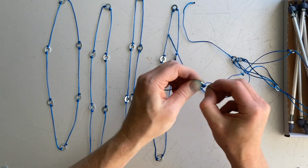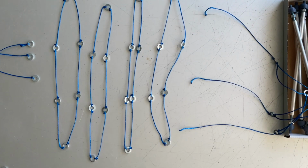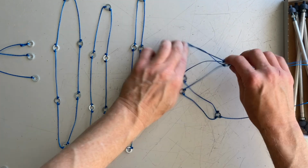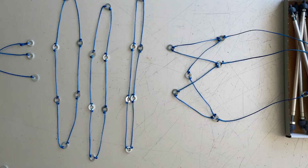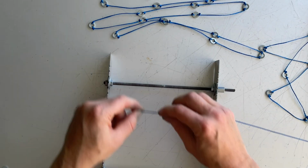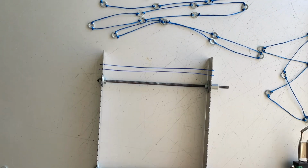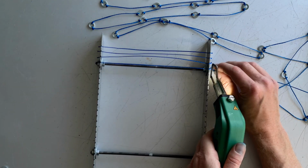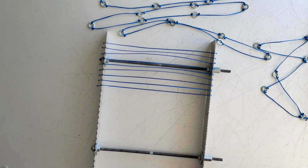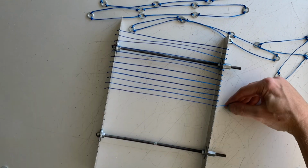So now we have the hexagons, and to attach these and start extending the structure, we tie the 3 loose ends of the long cables to every other middle ring of the first hexagon. Now we're going to need more of the longer cords that hold the twists together, but fortunately we only need 12 of these. Same process, but with a different distance between the plates. Cut with a little extra length and then blowtorch the ends so they terminate in a blob.